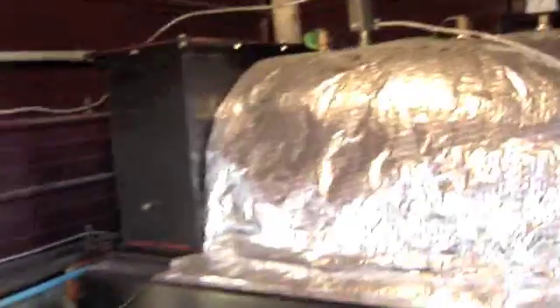Inside we have an EFM Coal Stoker backup system, and as you can see we're running about anywhere from 250 to 300 stack temp. Pretty efficient. Three ton of refractory — it's a pretty big beast. Air comes up through the bottom.